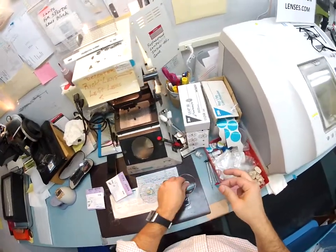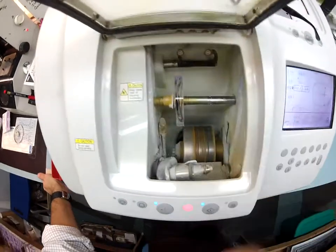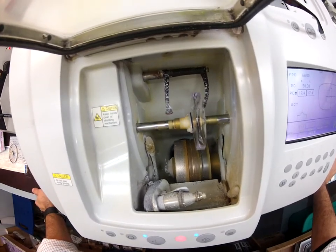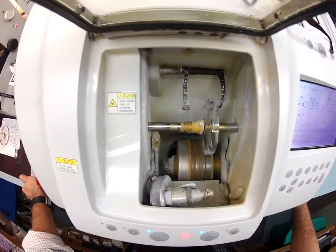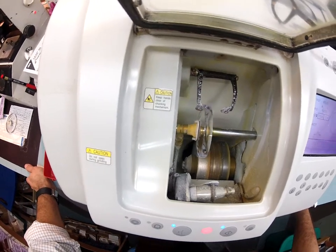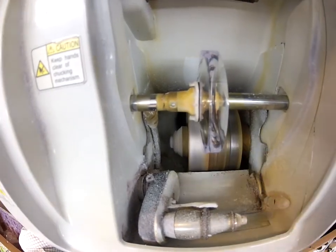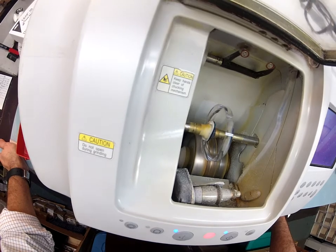I'm going to put the lens in the chuck and hit start. The first thing that happens is the LMU comes down and traces the shape of your frame onto the lens to make sure it's large enough to cut out. It measures the concave side of the lens first — closest to your eyelashes — then moves over and traces the convex side, away from your face, using the calipers to measure the thickness and know where to put the bevel. The cutting wheel is down here on the bottom — a heavy-grit wheel that grinds away the polycarbonate — and the center wheel with the channel puts the bevel on so it stays inside the frame.